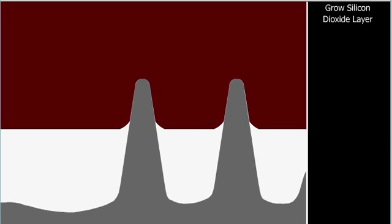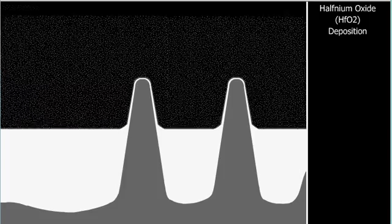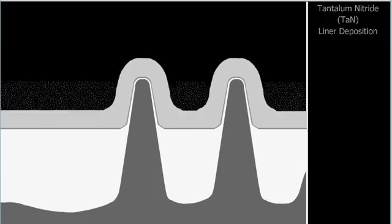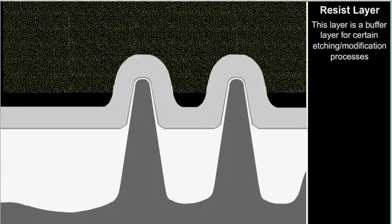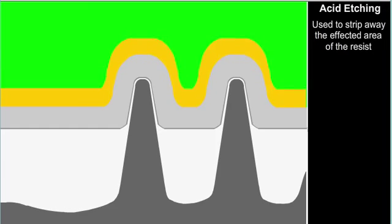Using LP-CVD methods, we place dielectric layers such as hafnium oxide or silicon oxide on the fin. We deposit the gate metal and etch it into strips perpendicular to the fins. Typically, we use a silicon nitride dielectric to isolate the fins and the gates.